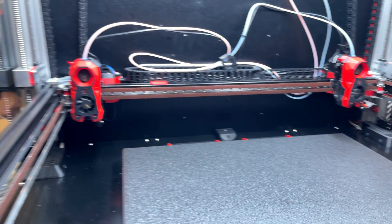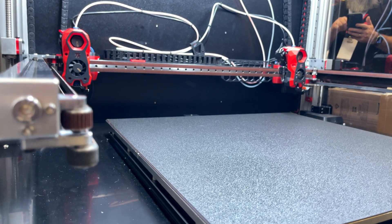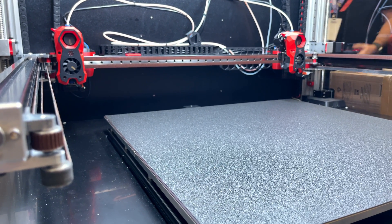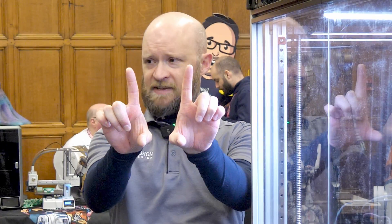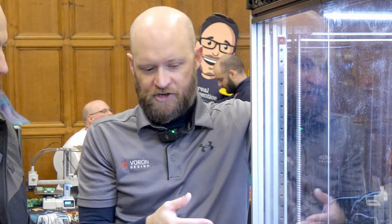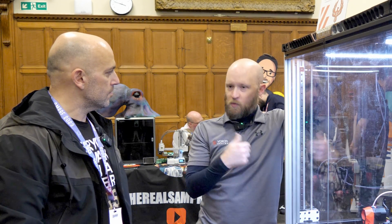The difference between this version of VoronTap and the currently released version is that the standard VoronTap uses a single MGN9 50mm long rail, whereas this uses a pair of VR2 precision slides. Being paired, you lose any ability to cant and rock under accelerations. The downside is they need to be on a machined part, and there is potential for them to cant slightly if adjustment isn't very careful — which could cause binding. It takes more time to balance everything just right, but investing that time yields better results.